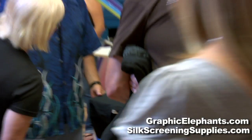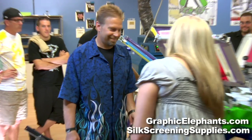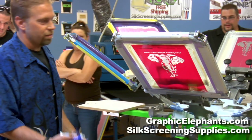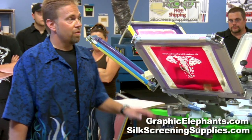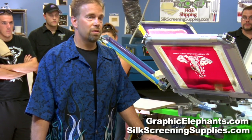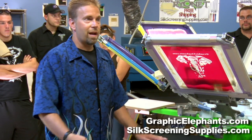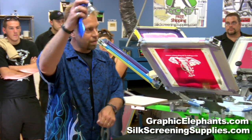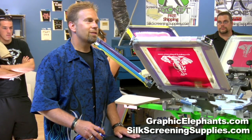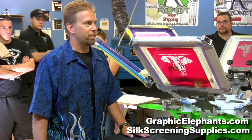This is advanced techniques, folks. It's good though. I think it works. That's pretty good. And we can do this with multiple colors. We can do this in line, as it's going down the dryer. We're not adding a tremendous amount of cost here. If I'm going to do a 100% foil application like this, I may have to run that down the dryer, stack, go to the transfer machine, cut foil, put it on, do my transfer, let it cool, peel it, burnish it, second set it, all that. So ultimately we're adding foil at a fraction of the cost it takes to do 100% coverage foil.